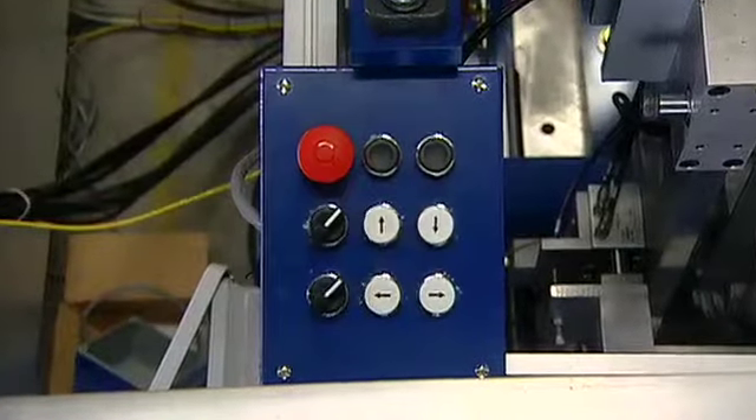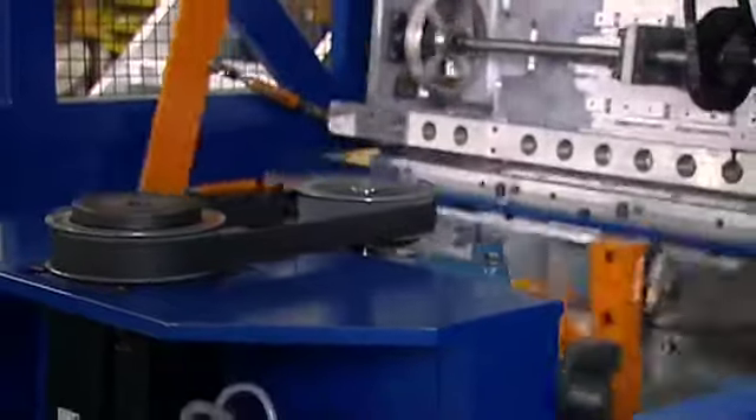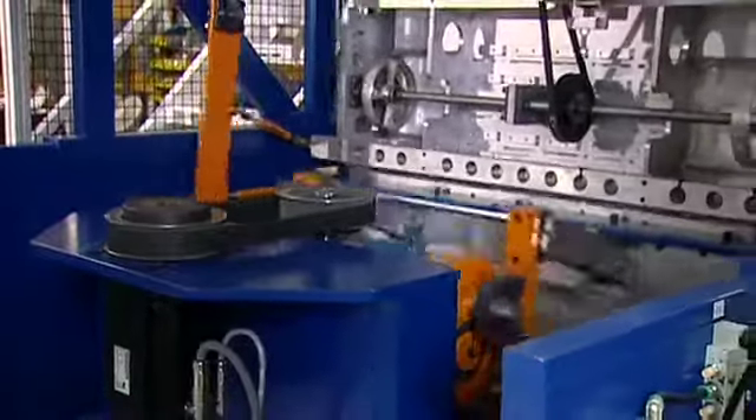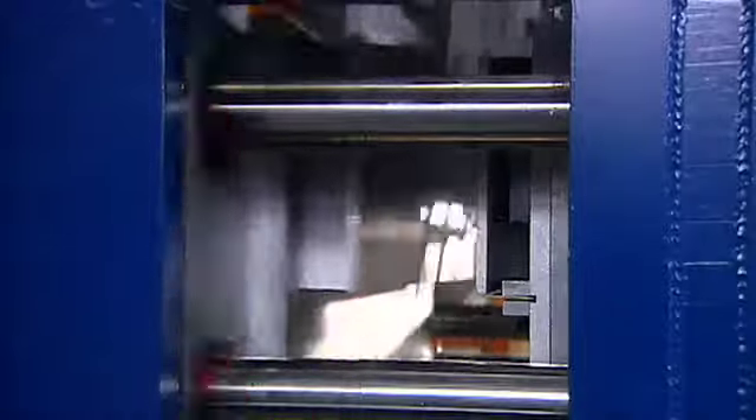One of the features we really like is a little panel with four simple buttons — up, down, left, right — so the operator can adjust the trim as needed. We don't actually call the trim press a trim press. We call it a miracle press, because it's different from anything that's ever been out there. We run the moving platen back and forth using a servo motor and we can change the speed of the platen. We'll pull back really fast, slow down to give you time to feed the foam in, then accelerate to full speed. The best part is we're always cutting at 150 cycles per minute. When you're cutting foam, a fast cutting action cuts better than a slow one. So regardless of how you're running thermoforming, it's always running fast in trimming. We slow the platen down and then speed it up to cut — nice clean cut, always the same, real consistent. The operators are going to love it.